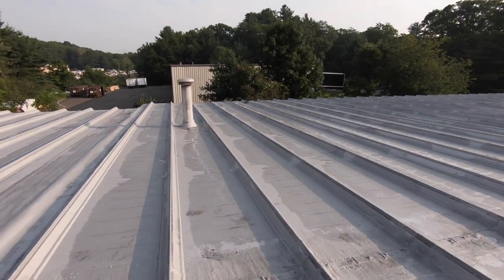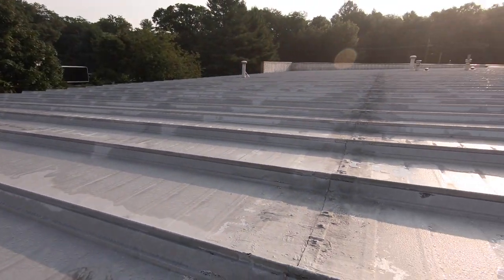The rest of the roof is good except for these joints. Any joint on a metal roof — on any roof — you need to have reinforcement. You cannot just put tar; the tar will crack. Anything you use has to have reinforcement. You put tar with a mesh, you put polyurethane with a mesh. It's like concrete with rebar — you need concrete with rebar, because concrete by itself cracks.